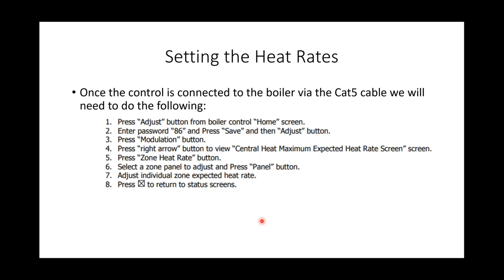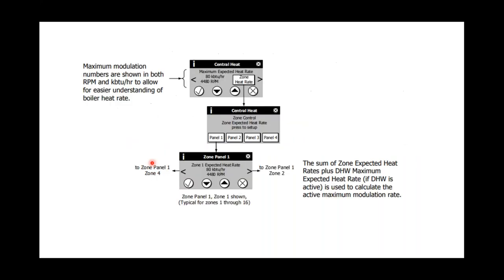To set the heat rates, you go into modulation setup — the same menu for altitude changes — and a zone menu will appear. Press that button and it allows you to set heat rates for each zone. It'll show panel one through four; dial everything in. Zone panel selection allows zone one through four with settable firing rates for each zone. If you have a home with four zones of heat, the four Sage panel zones cover those, and the domestic hot water terminal on the boiler still works independently. If at any point the boiler isn't turning on and you jump the DHW terminal, it will always fire for domestic hot water unless there's an error — this quickly tells you if it's a boiler issue or an external system issue.